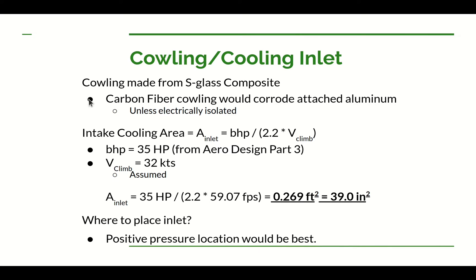I've already gone through figuring out the shape of the aft fuselage with the engine, propeller, inlets, and outlets. The shapes got so complex and curvy that doing them with sheet aluminum would be too difficult — at least on the aft part, and probably on the whole fuselage. I'm planning to use S-glass composites to make those shapes, so I can make them any form I want. Carbon fiber is certainly a possibility, but since most of the airplane is aluminum, I'd need to electrically isolate a carbon fiber fuselage from it, and carbon fiber is also more expensive. So initially, I'll try an S-glass fuselage and cabin for the outer shape.